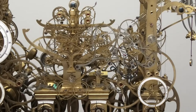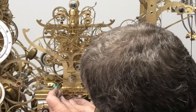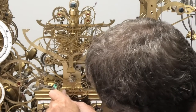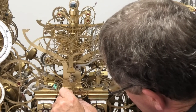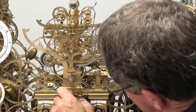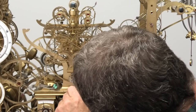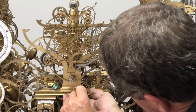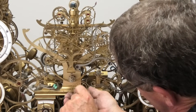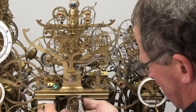Then there are the two small gears. They are not strictly required to be removed, but for safety's sake, when one's handling this large assembly and then projecting below the bottom of the lintel, I think it's best to remove them. Again, it's two easily accessible screws. With the two gears removed.